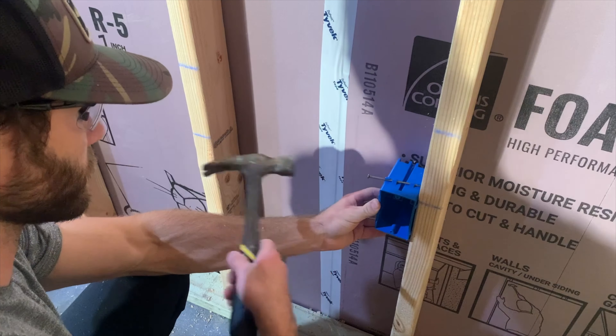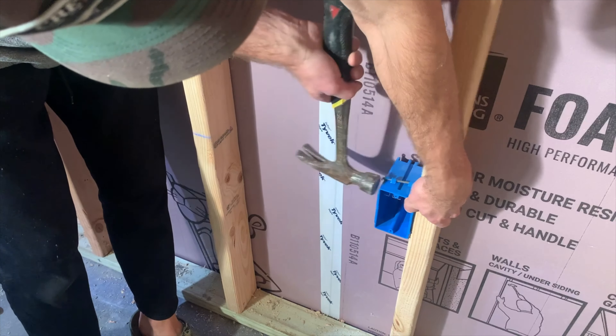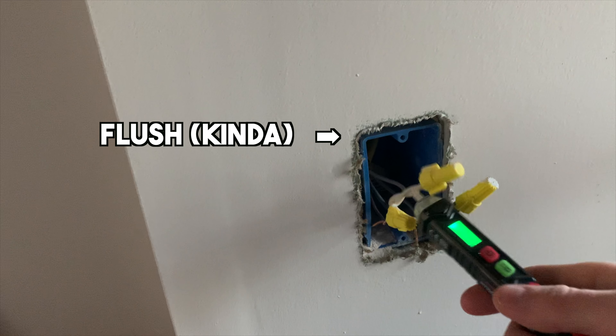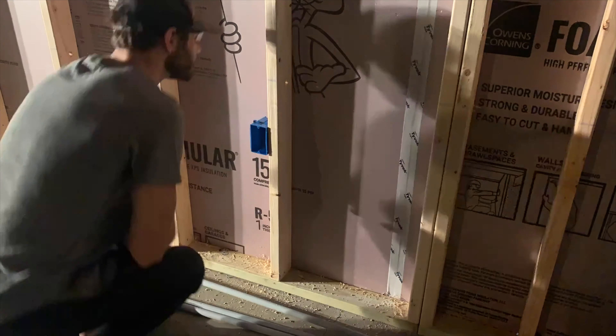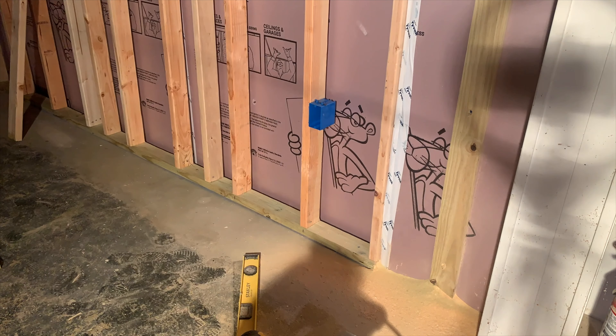After marking the outlet height, you position the outlet box in place. There are tabs on the side of the outlet to make sure you're a half inch in front of the stud, so when you install the drywall later it'll be flush with the receptacle box. I'm going through making sure we're flush with the line, positioned on those tabs, and then tapping them in with the provided nails. I also like to remove the tabs before actually installing the receptacle box.